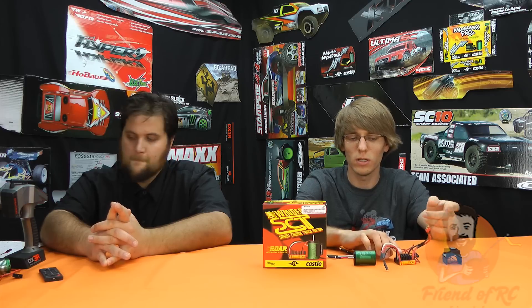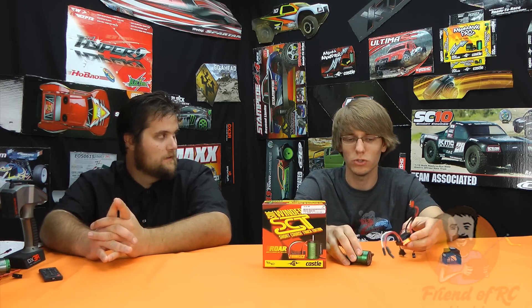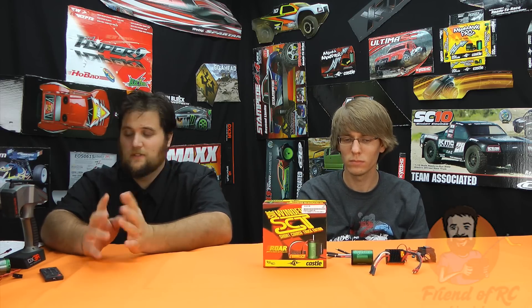So again, more torque. The V2 now has, I think they said 40% more current carrying capability, which means you're not going to overheat. The biggest problem we had with this one — running it hard — kept hitting thermal shutoff. And running indoors you really, really saw it. Outdoors it wasn't really as much of an issue.